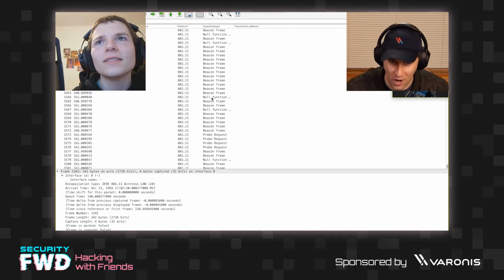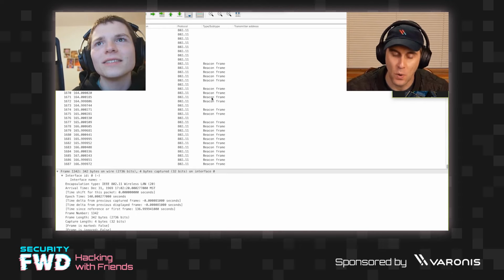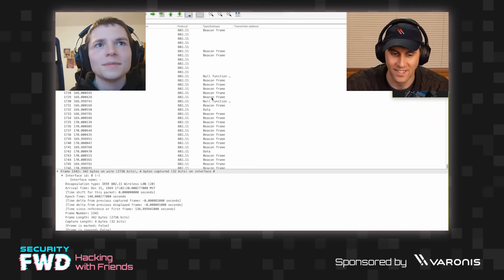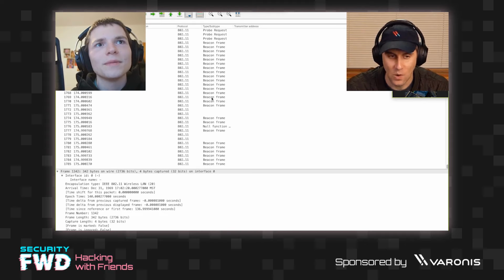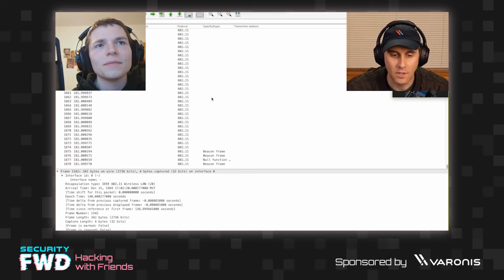But still, encouraging progress. What we're doing now is we're actually taking this little microcontroller over serial, and we're recording this to a file on, well, in this case, my root directory, but just a file on the computer. Then we're opening it up and watching it live in Wireshark. So once we get this source and destination problem sorted out, we can at the very least see where these beacon frames are coming from and start learning more information about the networks that they're representing.